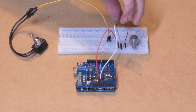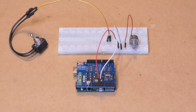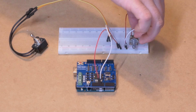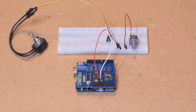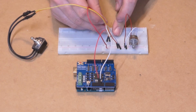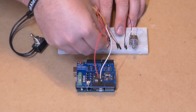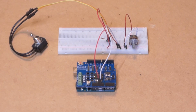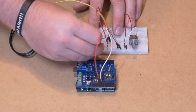First we're going to hook up the rotary potentiometer. In this orientation we're going left to right: power, sensor, ground. We hook up the ground to the far right side pin of the potentiometer, leaving the middle pin open for the sensor output. Next we hook up our power to our single pole switch. We're going to use it like a sensor, rigging it up exactly like a photo resistor, with a resistor inside the circuit, splitting the ground between the sensor and the actual ground connection.